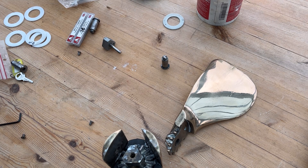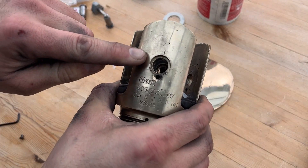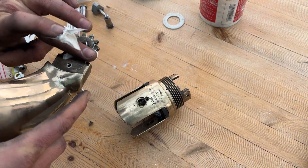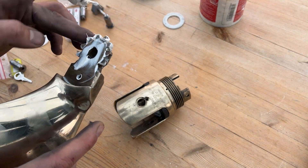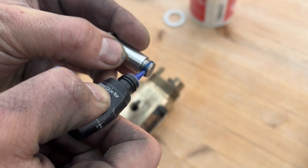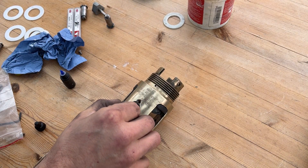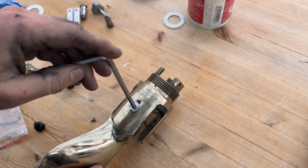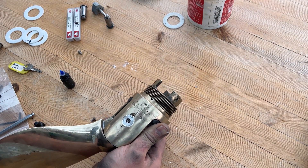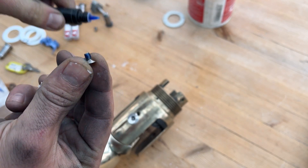Now it's time to put the propeller blades back. We've got the number one propeller blade with marking number one, the number one hub, and the new pin made for the number one propeller blade hub. Apply a good dollop of marine grease over all mating surfaces on the propeller blades. Apply a liberal covering of Loctite over the guide pin threads and make sure the threads are clean. Put some marine grease over the guide pin itself as the blades will pivot around it. Bolt the guide pin in until the recess aligns perfectly — if it isn't aligned, the locking bolt will not sit flush.